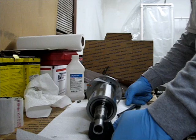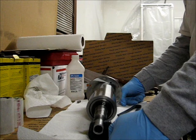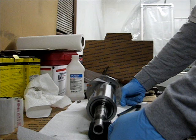So I've reset the torque to 5 degrees torque to angle, or somewhere thereabouts. I mean, how do you estimate that? I got an idea of what 5 degrees looks like, and I stopped when the load got too severe, and then called that 5, decided not to go any further than that.